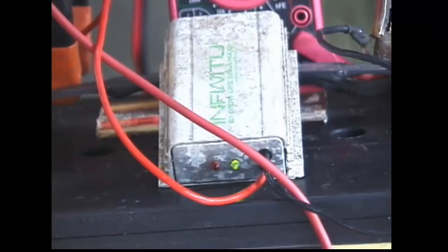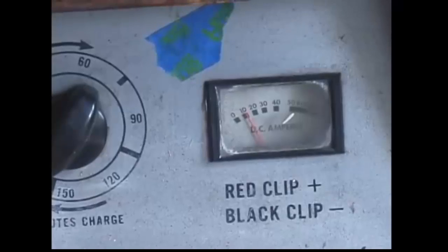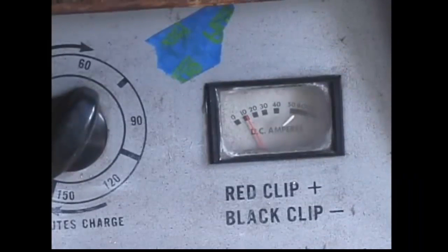Initially, if the battery is completely dead and has sat for a long time, I would use a high-amperage voltage charge to start it going — it may take hours to get going. Any reading on the charger showing some amperage being delivered is where it's starting to charge. You can see in this case the charger has started to get up to 10 amps. If it won't take a charge, I would use jumper cables to a good known battery, start the charger charging for 15 minutes, disconnect it, and see if it will start charging on its own. Some chargers won't charge a battery they can't see, and often can't see a battery with less than 4 volts.